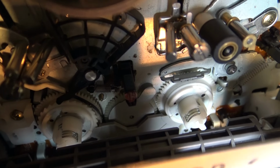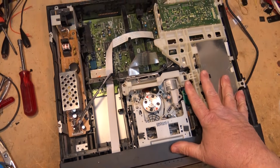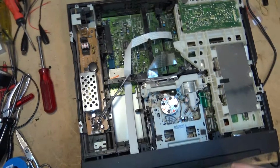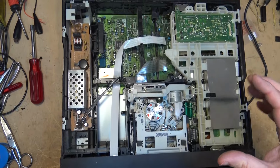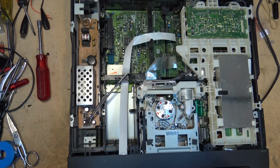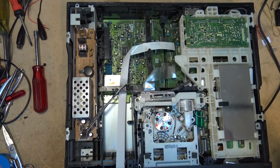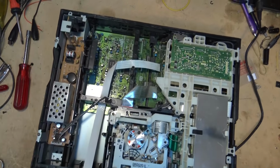That's the problem. And the EVS7000, for those who are not aware of what that machine was, it's the big brother to this one. It's the same mechanism, but it also featured the PCM digital audio sound. Now, 8mm and Hi 8 had the ability to not only record the AFM analog hi-fi soundtrack, but it also had a reserved area called the PCM digital stereo track. And that allowed you to dub digital stereo music in after you'd recorded a tape. And on playback, you could pick either the AFM stereo or the digital PCM stereo, or a mix of both. So it really was a good deck.